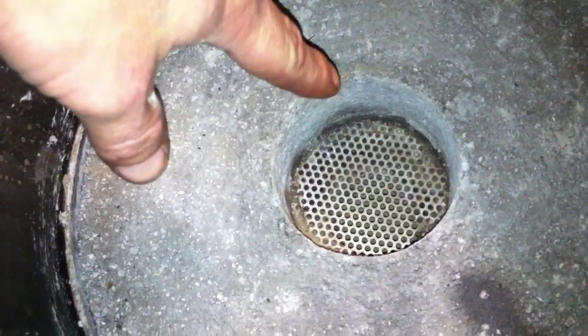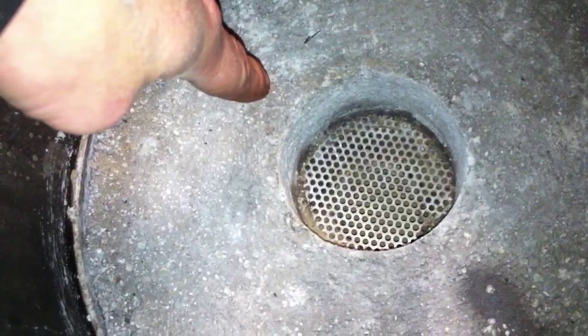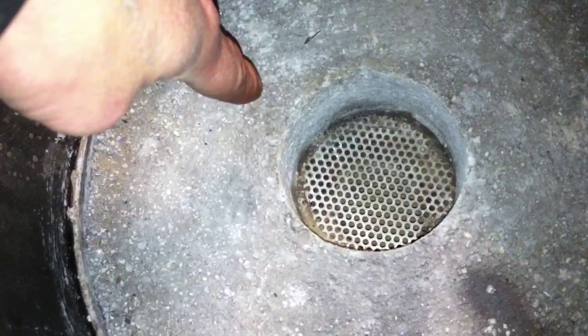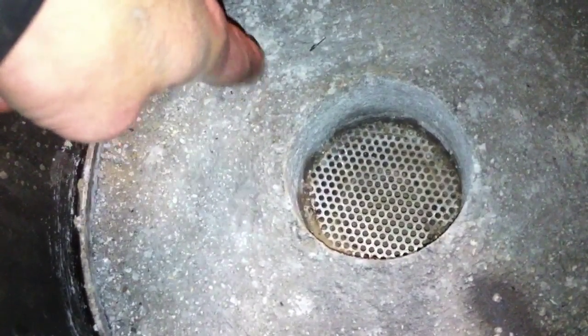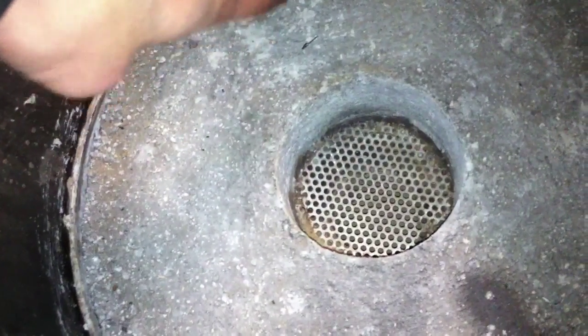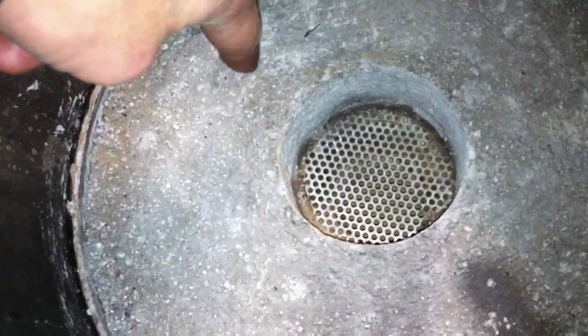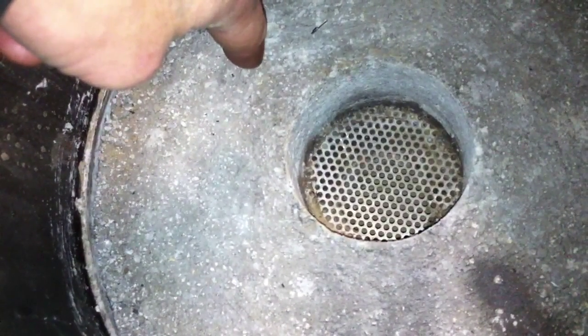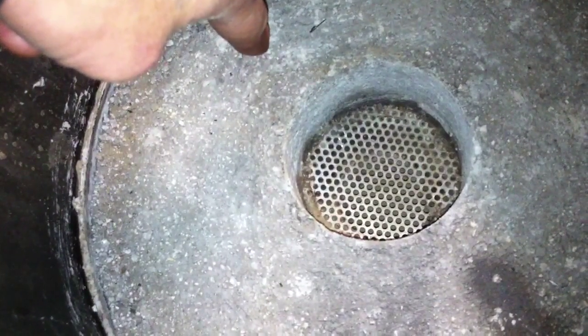Then there's another layer of two inches of regular refractory — I think this one's rated at 2,000 or 2,500 degrees. It's a little bit rougher, but I like it better because it dries a lot faster. So if you guys are doing that, use the refractory that comes in the cement bags as opposed to the one that comes in the bucket — it dries faster and it's much harder. I think it's going to hold up a little better.